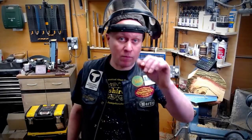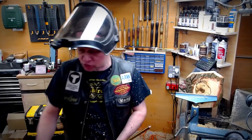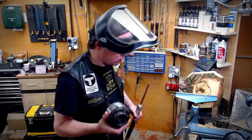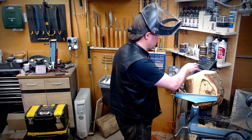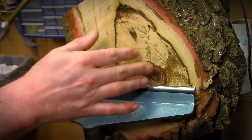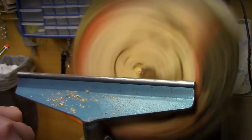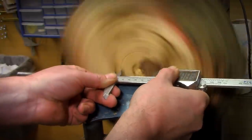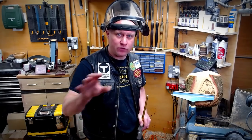Okay, that's good. I'm happy with that now. I'm happy to put a tenon on, and I'm going to use a relatively large set of jaws — using these with a 60mm tenon, which is about two and a half inches, something like that. That is going to be good enough to hold for the rest of the bowl. To make the tenon, I'm going to switch over to a three-eighths bowl gouge and a spindle gouge just so we can make sure that tenon is absolutely perfect for the jaws I'm using.